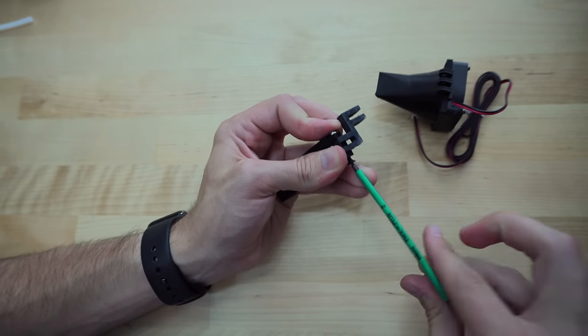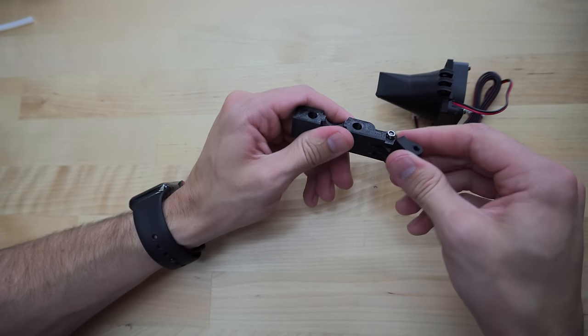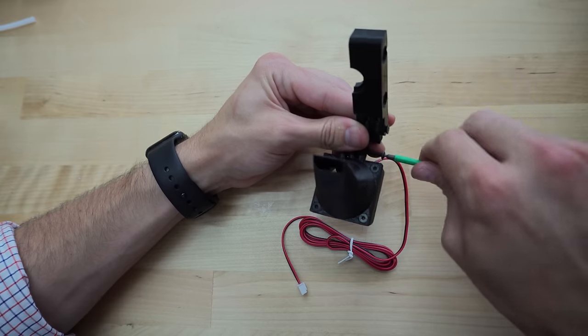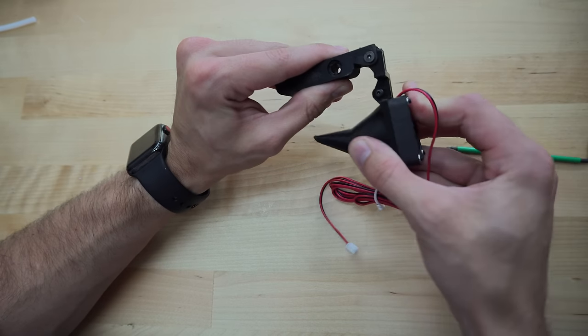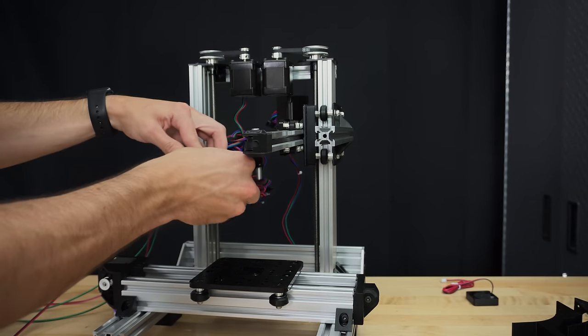Basically, if the cold end fan ever stopped working, there is a chance that the cold end could reach a high enough temperature that the plastic holding the extruder could flex. Worst case scenario, the extruder slips out of its holder and lands on something flammable. To be safe, you should choose a plastic with the highest glass transition temperature as possible, or avoid designs that use this setup. There are two other things we need to discuss: the part cooling fan and why the extrusion drive sits on a separate rail from the extruder.